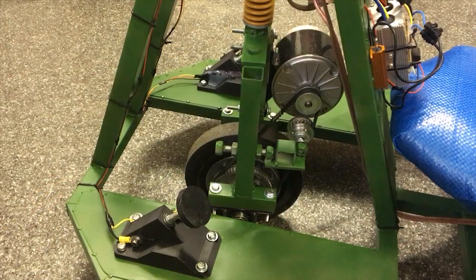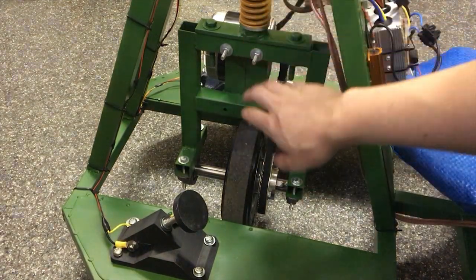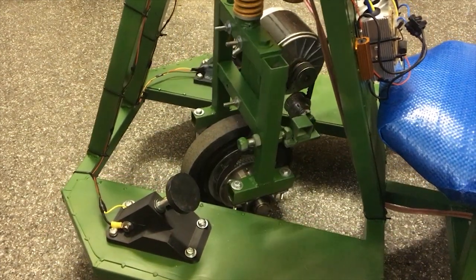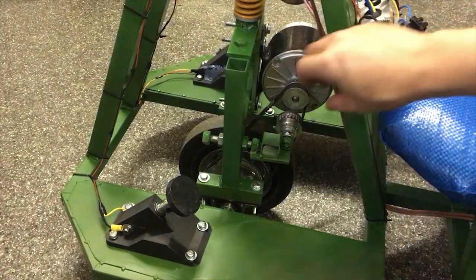For tension, an additional tooth pulley was used. To connect the tooth pulley with the axle, a feather key was welded onto it, and the gap was grinded into the tooth pulley.